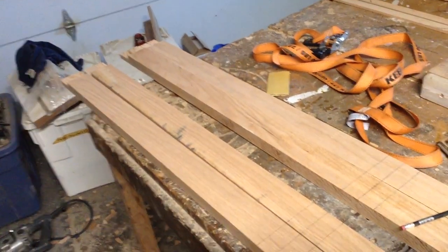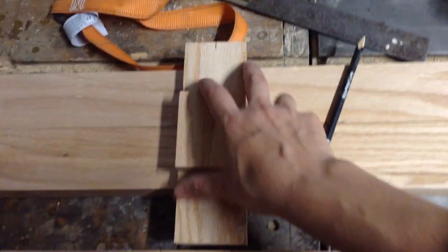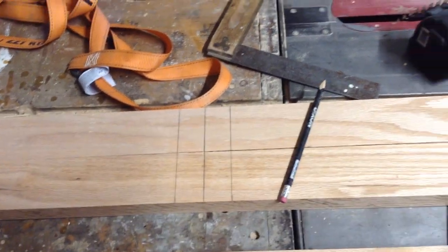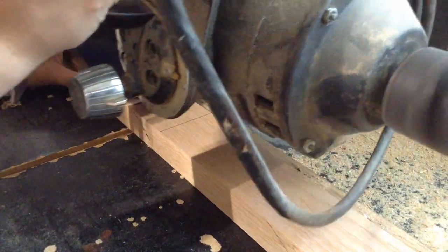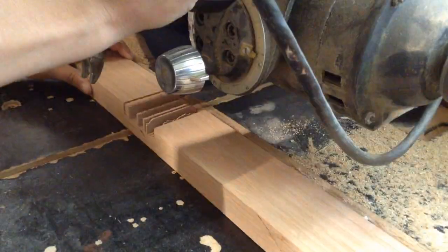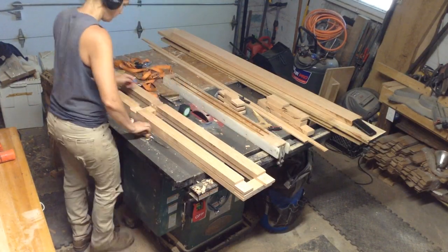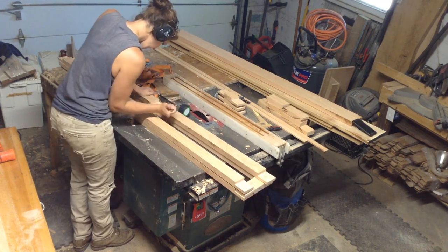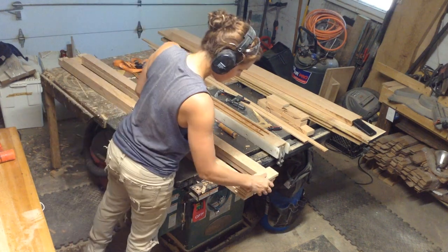I'm also going to be putting a center partition in these just for stability. This is more decorative than supportive, so I really only need those corners and one in the middle, and that will be more than strong enough to hold up these cabinets. Same process — I measured the width to get it accurate, and this time I'm not going to use a stop, I'm just going to cut on the inside of my two lines. The height is still the same, and then I could go through and clean up between my two marked lines. You can see how the short pieces on the edges — I obviously built two of these, a front and a back — and I take that excess material out of the center so the center partitions fit as well as the ends. That is going to be the front and the back of the base.